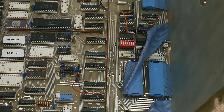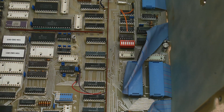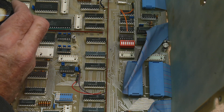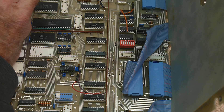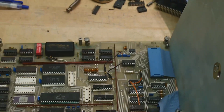Data Sentry memory backup - I'm not familiar with these chips. MC3447, I'm not sure what those are. They're next to the batteries so they might be RAMs. AMI7813 - I don't know what that is, could be a floating-point processor. There's also an Intel part, which is kind of interesting in a Motorola design.